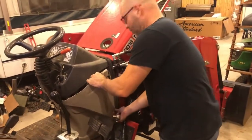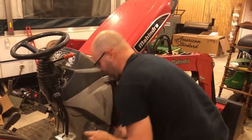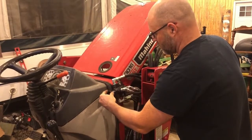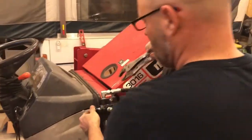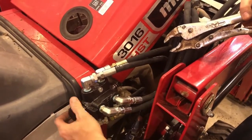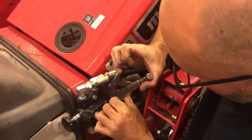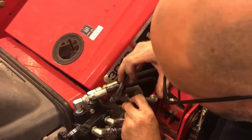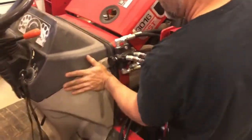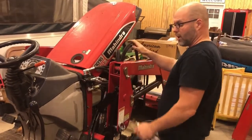We're going to get this plastic panel put back out of the way and then put the knob on. The knob comes in the hardware kit and has a lock washer on it — spin that into the valve. To get that knob nice and tight I'm going to pinch on the very outside of this piston with vise grips and tighten that knob. Do not grab with vise grips on the inside of that piston — you will mar it up and have trouble sliding it or have leaks in the future. I'm pinching on the outside of that circlip, give the knob another quarter turn — that's tight. Now's a great time to test that knob going in and out. It's not hitting anything, not obstructed. We can drop the hood and get ready to run the lines to the rear.